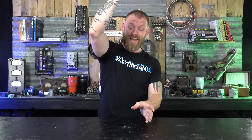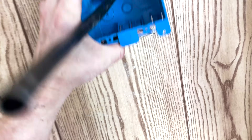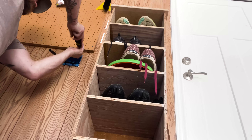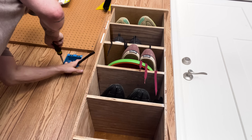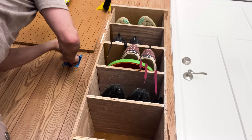Get all that romex down, then go below and reach up into the hole and pull the conductor out of the wall. Once you have your 8/3 out, take the two-gang pop-in box, pop open one of the tabs so the conductor can get in, then push the box into the wall with tabs folded down. When you start screwing it, the tabs fold up and hold it to the drywall. Do this by hand so you can feel the tension — don't over-tighten or the little flaps in the back can break off.